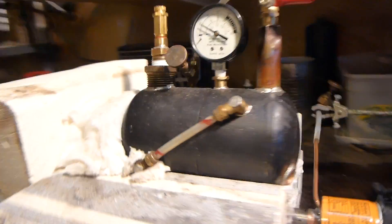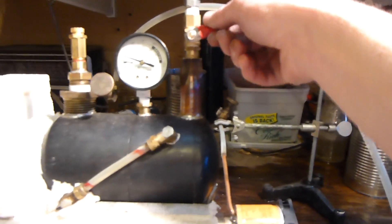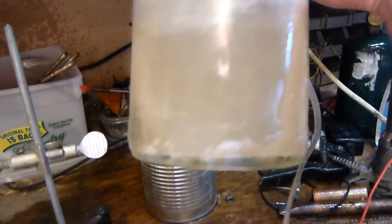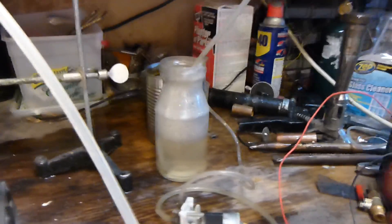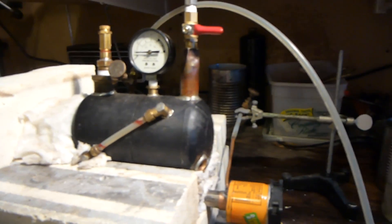After running my engine for a while, there's like a cloud in here from all the steam and water vapor put into the atmosphere. I was running this steam engine for probably an hour — it was doing real nice. Just emptying the steam out makes a rumbling sound. Basically a steam bubble forms down there and as soon as it hits the cold water it contracts, making a loud pulsing sound. That was fun — hope you guys enjoyed that long run of the steam engine. Thanks for watching.